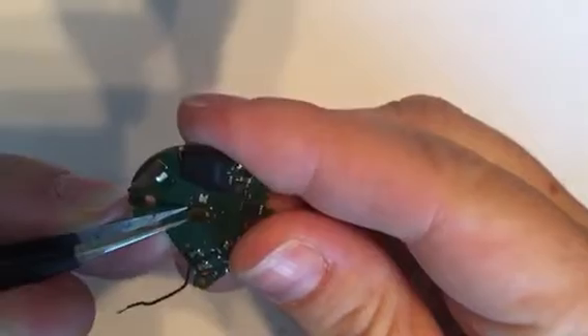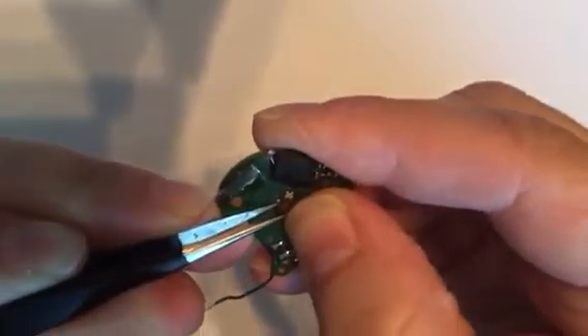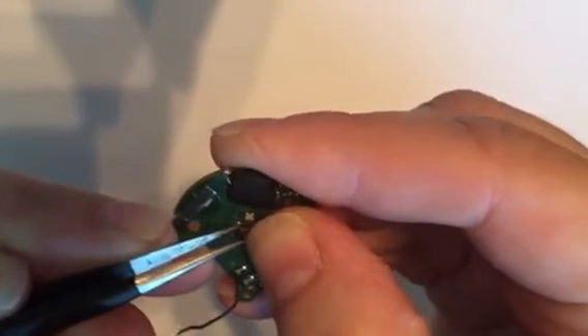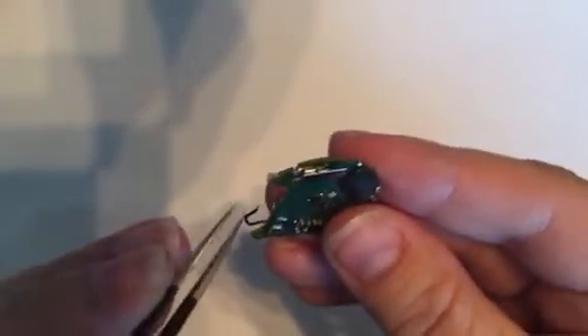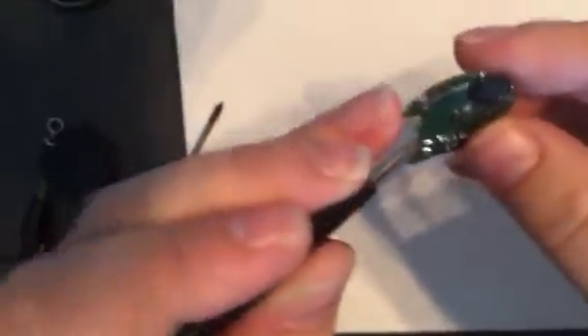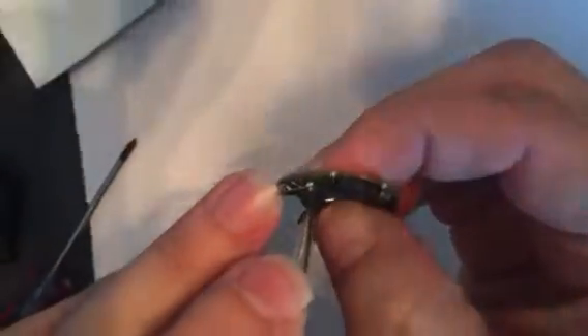So I've got the circuit now. And what I do is I very carefully lift this corner here. Having these tweezers that are really pointy is very helpful — otherwise you can try to do it with your nail; I've done it with my nails, it's just harder. You lift this corner, and then underneath that switch is the connection point that completes the circuit to trigger the Pokemon Go Plus. I just take and slide this wire and put it right on that connection point underneath. Push that back down.